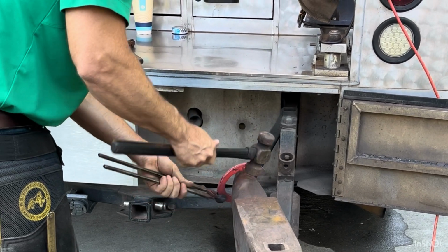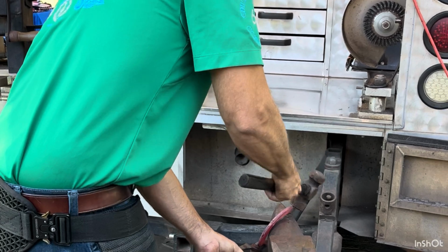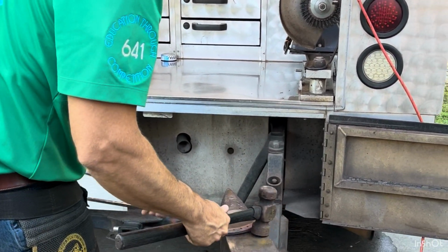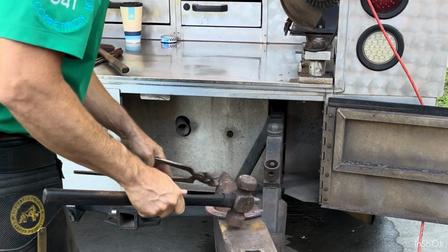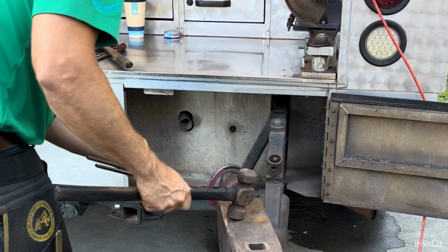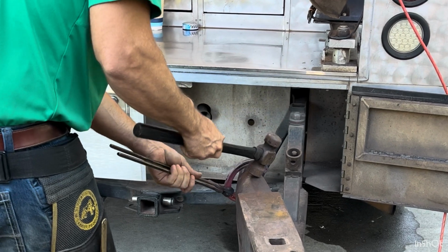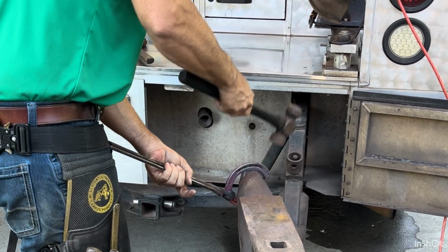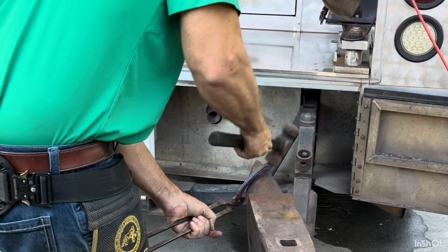Go out to my widest part, come back in, go back to my lateral. I just place my contact right where that widest part of the foot is, do a slight straightening blow, then cross over. There's my quarter bend, and then straighten again.